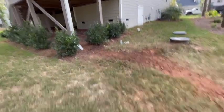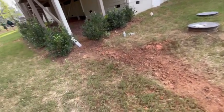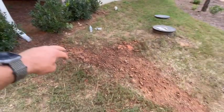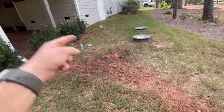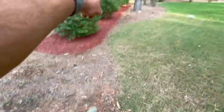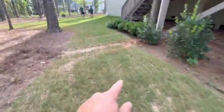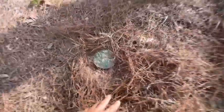And we're all set. So you can sod over the top or cut the sod and replace it. This customer chose not to because it does cost a little extra. Got the filter, it's running in. We tied in this corrugated foundation drain, tied this in, and then a little pop-up right here will flow down this slope. Over here, you can see it cleans up. It's only a thin strip, so really it does not make a big mess. And you got this pop-up, barely notice it with the pine straw. That ties in there and around here.